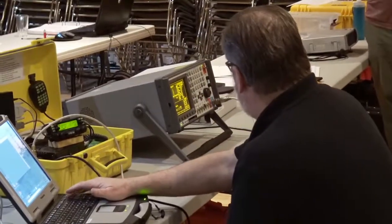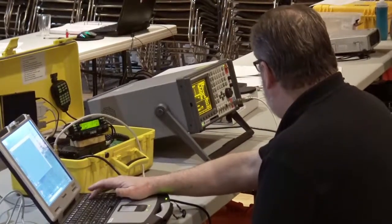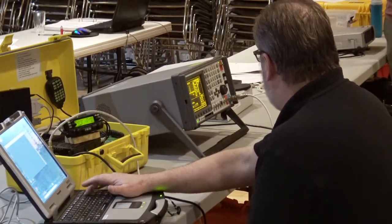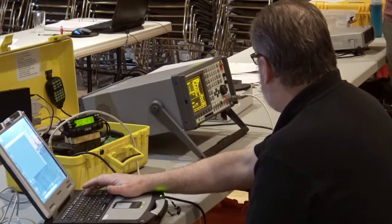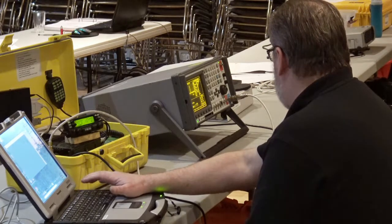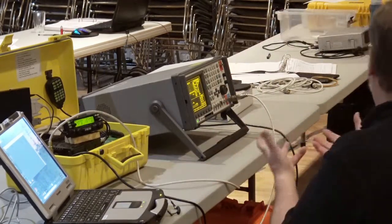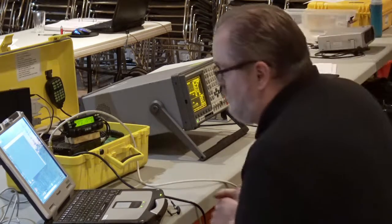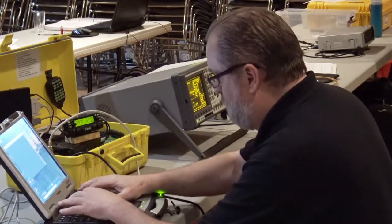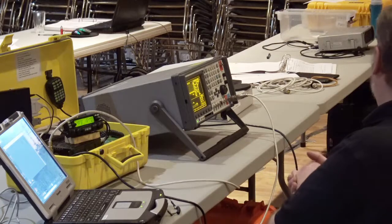So, what I'll do is start hitting the plus, and you'll just watch that part right there. We hit the plus, we just keep going until we get to 2.75. You can hold it down too and get there a lot faster, but all of a sudden it'll go whoop, and take off very quick. So, 2.74, about as close as we can get. I hit the space bar. Now that's all there is to tune it up. Just that simple. If I hit X to get out of the calibration mode, and I type XMIT L, which is the transmit level, it has a number of 142.